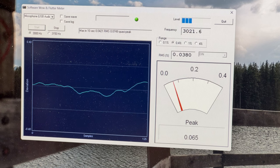So, guts to tell ya, underneath this board is a metal plate with some transistors attached to it. You can just kind of see the one right there where my finger is. And that is heat sinked to this plate. So what I ended up doing was I took that whole plate off with all four transistors, and I ended up reapplying the thermal grease to it. So the upshot of all this work is this whole area is running much cooler than it used to be. First time I fired up and ran this, it seemed like it was getting fairly hot with almost no activity going at all. And now I've done this whole tape and it barely got warm.